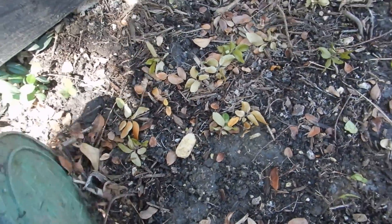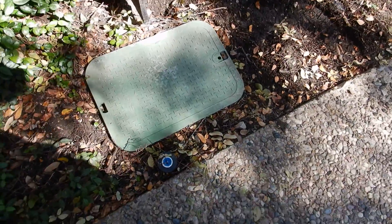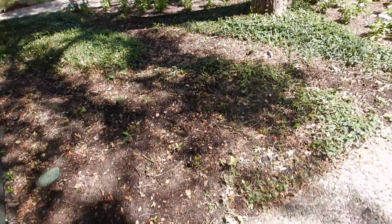Did you find something? That's just the zone for the sprinkler system. The ground is awful wet here. I'm not saying it has to be the lawn sprinkler system. You failed the water meter test regardless. You do not have a main water shutoff valve to the house regardless. I cannot locate a check valve for the lawn sprinkler system regardless. Those things we don't have.